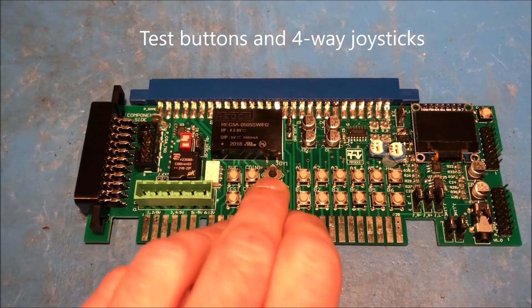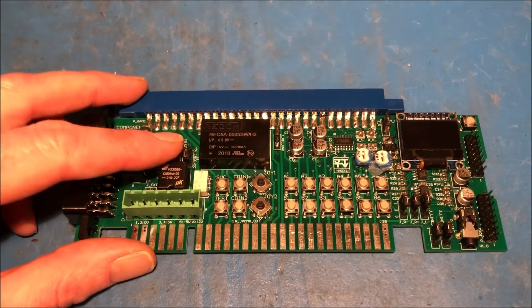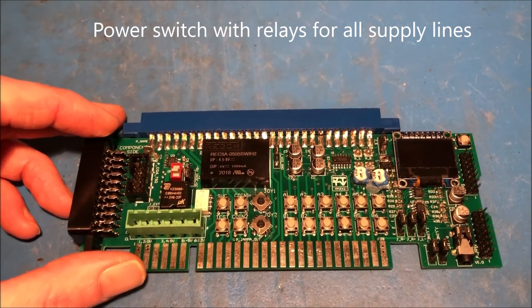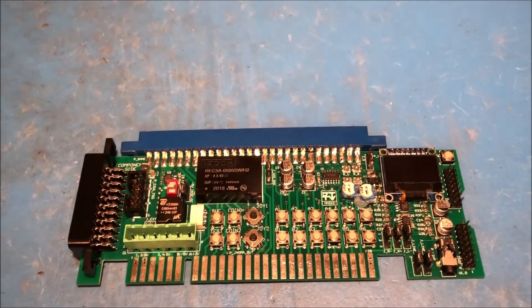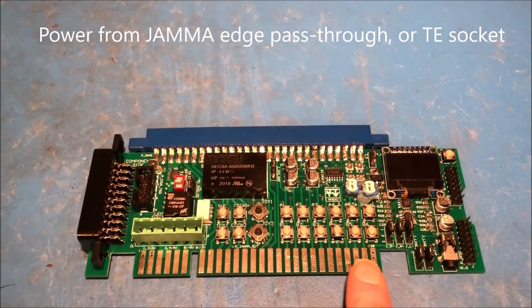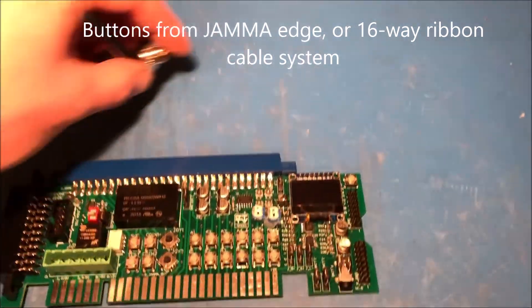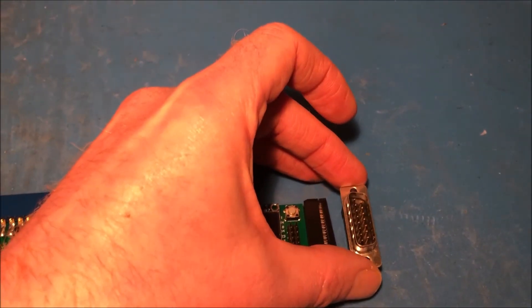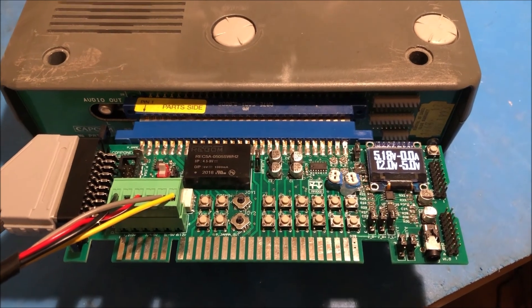I've got a full suite of buttons here and these little four-way joysticks so I can test boards without having to put a load of wires off this thing. There's a switch here to power the game board, which via these two relays will apply the 5 volts, the 12 volts, and the minus 5 volts. If you haven't got a minus 5 volts, there's a DC converter on here. You can bring the power in on this green header or from the cabinet on this jammer connector down here. Similarly, buttons can come in from the cabinet along here or you can use these Neo Geo compatible headers, with ribbon cable and these connectors to add extra buttons and kick harnesses.